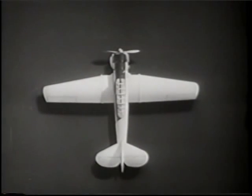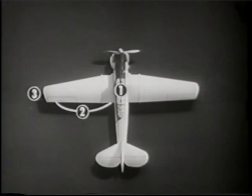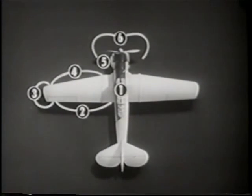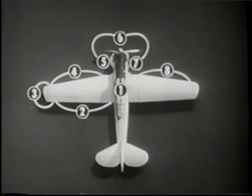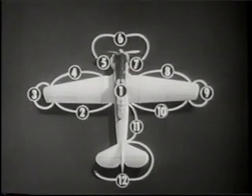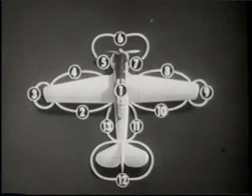Establish this pattern of checkpoints in your mind: the cockpit, the trailing edge of the port wing, the portside wing tip, the portside leading edge, landing gear and portside engine section, the front engine section and prop, the starboard engine section, the starboard wing leading edge, the starboard wing tip, the trailing edge, starboard fuselage, the portside fuselage, the empennage and tail section, the portside fuselage and baggage compartment.